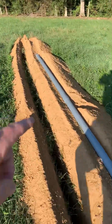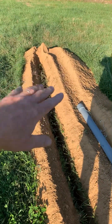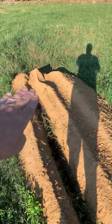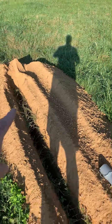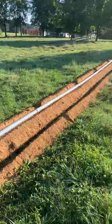The other end of the 300-foot run will have a pad mount transformer — you see those sitting in the yard sometimes. We'll put another rigid 90 sweep, come up, and it'll just stub up off the ground. Then later, when the electric company comes to pull the wire, they'll set the pad mount and we can tie our temporary electrical service into it.